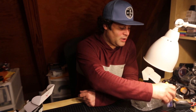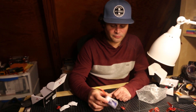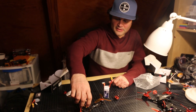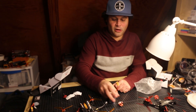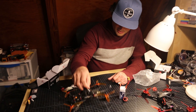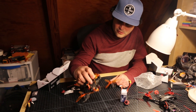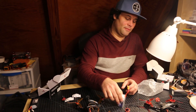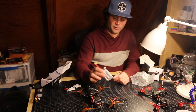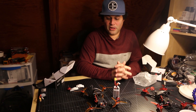The most important part is that to run this motor I should be able to use the 850mAh 5S battery — a 5S setup through a smaller motor with the KISS ESC on this quad. On top of that I'm going to find other ways to save weight: an MMCX antenna and lighter straps. The theory is I can run a lighter motor on 5S with a smaller 130-gram battery on an overall lighter quad. As far as I know, there is no other combination on the market like this.